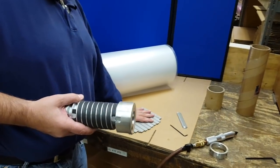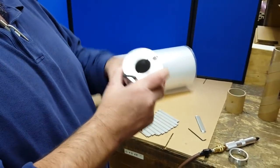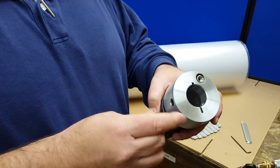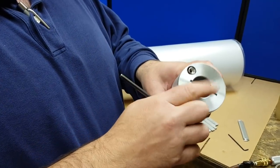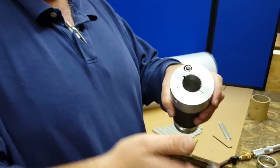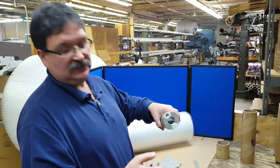One of the chuck's features is a built-in split bushing, bored to fit whatever through-shaft you're putting through. When you tighten up the set screw, the split bushing closes onto whatever shaft you have — you can see how it locks up and you get concentric locking onto your shaft so the air chuck stays concentric. If you ever want to remove the chuck from the shaft, you simply loosen the set screw, the split bushing opens back up, and you can slide it off the shaft.